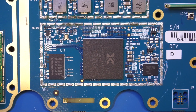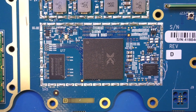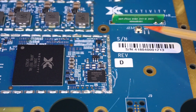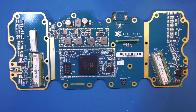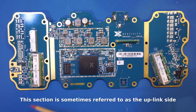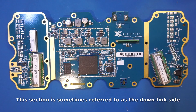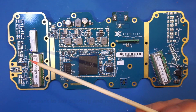Now remember, this Go X booster has built-in software that allows you to control it via Bluetooth using a cell phone. You can see the Bluetooth antenna — it is implemented on this vertical PCB right here. Because cell phone boosters need to send and receive signals from the tower and your cell phone simultaneously, you will see essentially two very similar sections of circuitry on this board. The cell tower side of the circuitry is to the left of the board, and the right side is for communicating with your cell phone. The uplink and downlink are duplexed on different frequencies, so you can see a duplexer on either side.